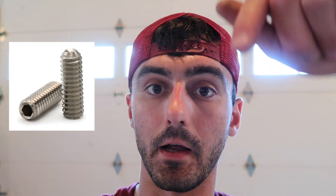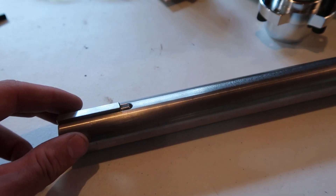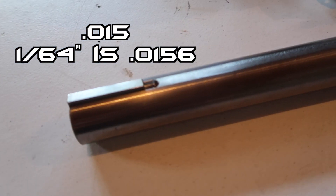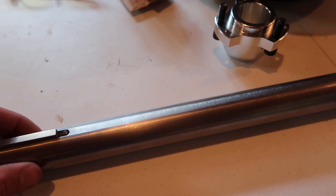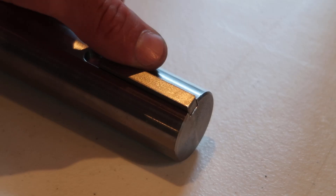The next part was a bit of a guess on my part. The bearings for this are not here yet. I know the bore is inch and a quarter, but when you slide an axle through a bearing, you need to be able to lock the bearing to something. There is a small set screw that comes in through the diameter of the bearing and you can screw that down to the shaft — that tends to work best if you have a flat to seat it to. So while I had the setup to put the keyways in, I just went down 15 thousandths — about a 64th of an inch — and ran the tool the entire length of the shaft. This made it simple because then I could flip the shaft, put that flat against the vise jaws, and I knew this one was 90 degrees to here. The bearings generally have two set screws, and my guess was that they will be 90 degrees from one another. Sometimes they're 90 degrees apart, sometimes they're 120 degrees apart — but I can recut that later. If it works, great, but you'll have to stay tuned to find out.